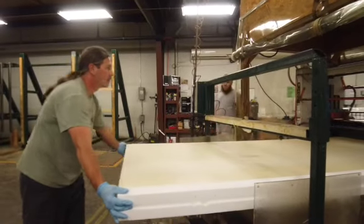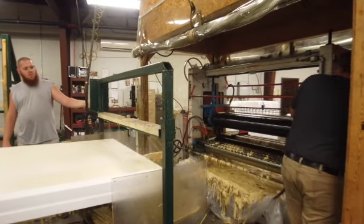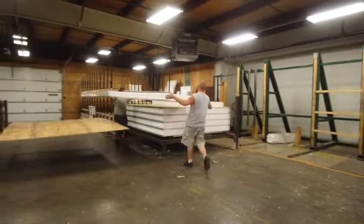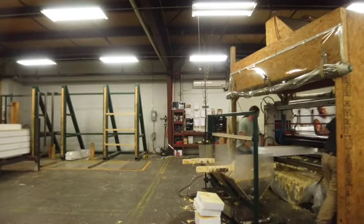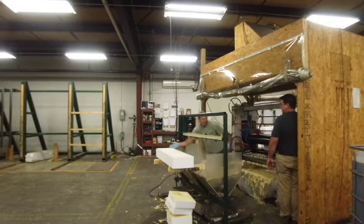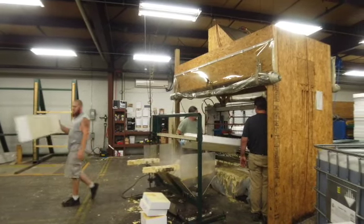So there's the water activation. That's applied on both the top and the bottom at the same time — there are basically four sprayers on the top and four on the bottom. We can set the glue machine to do just one side, like a single-sided panel. The basic process is that we load up both the top and bottom layers with a pool of glue which will coat the rollers, then we measure it to make sure it's the correct amount, and then we start running the presses through.